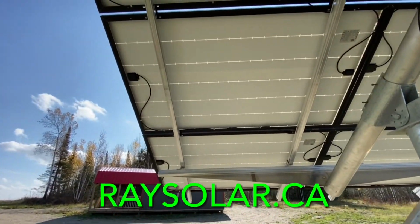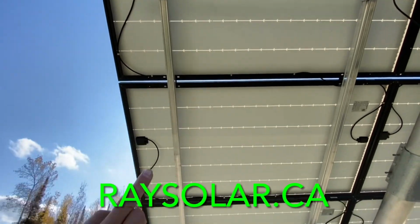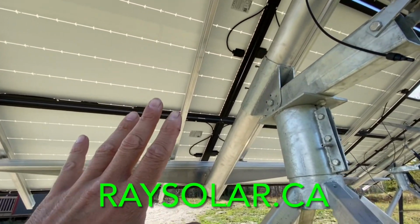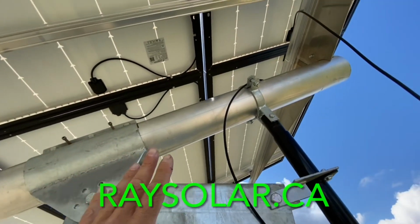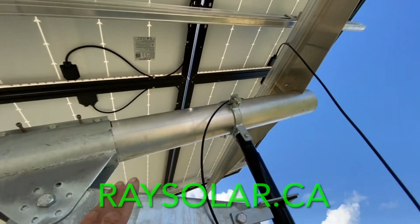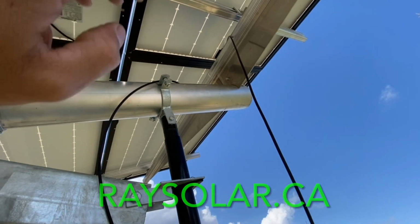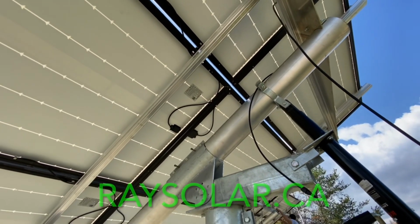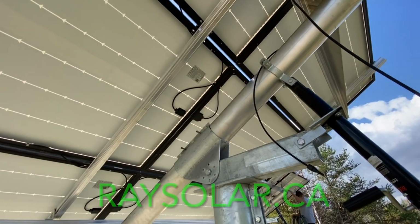Coming back over to the left hand side here, and then the same. And then what we're doing is we're always lining up our panels to ensure that the two home runs, so in this particular case it's one string of six panels, are coming towards the top of the array. And we'll show you in another video how that comes together combined.